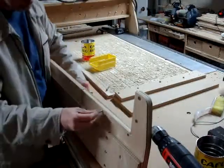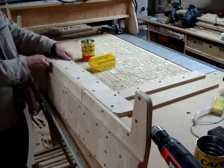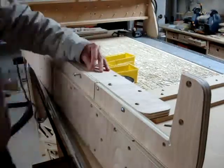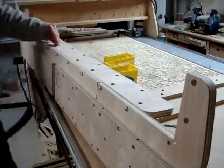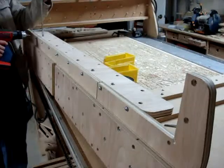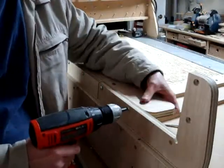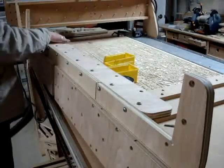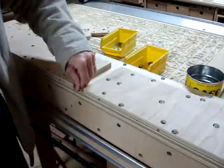Take the other similar piece and fasten it with the 1.5-inch screws and cross dowels. Make sure that the piece is oriented so that the X-axis motor mount hole is aligned with the piece at the top. The hole in the top middle should now be fastened using the X-axis, using a 1.5-inch screw and a cross dowel.